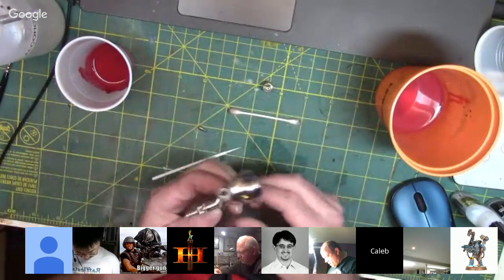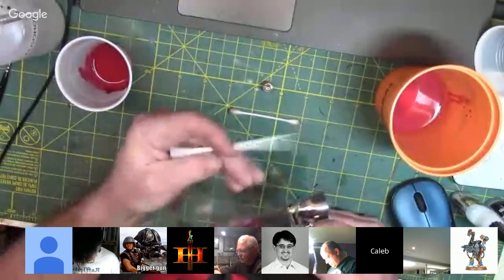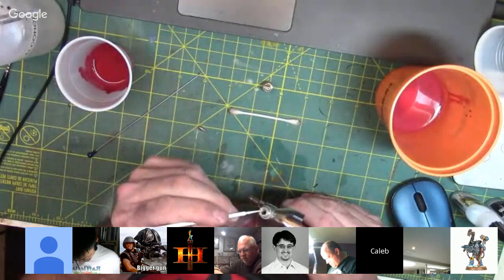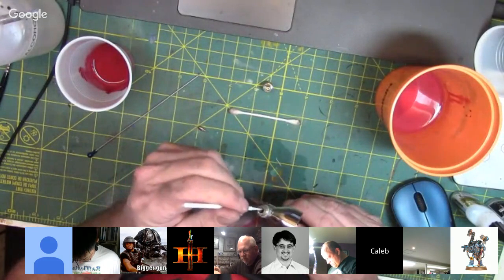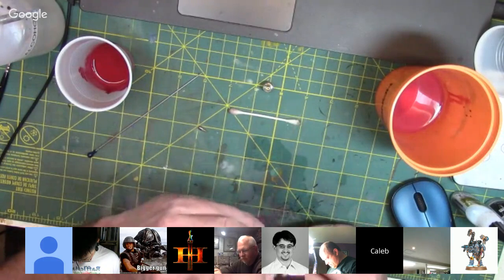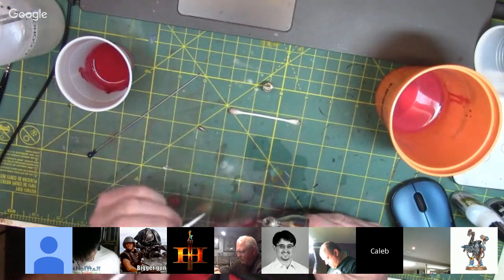Next, I have this little shoulder right here in the housing. So right here, I'll go ahead and take the needle out. Right here in the housing, I have this shoulder. And this is where the nozzle goes in and it seals against the brush. Sometimes we have a seal in here, sometimes we don't. This little shoulder is what will leak air sometimes.